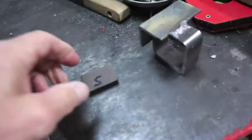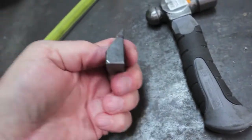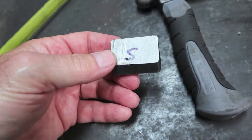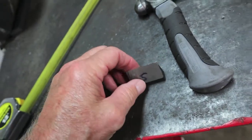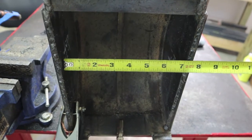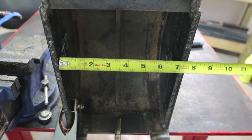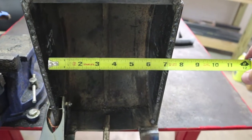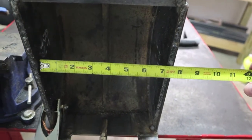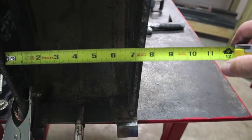The tooth going in the middle is inch-and-a-half wide by half-inch thick. I put an 'S' on that because it's slightly shorter than the others and it's going in the middle. My bucket — I wanted to go just about as big as I could with the propane tank I had, so I was shooting for seven and a quarter inches, but when I got done it ended up being just a little over seven inches. The trench should be good enough to put in a four-inch drain tile.